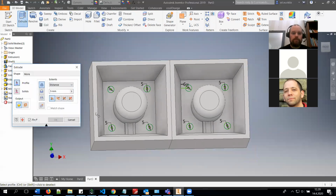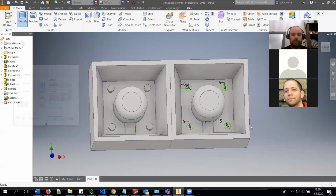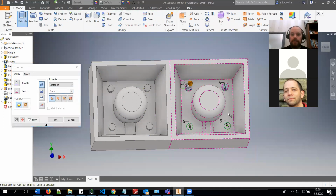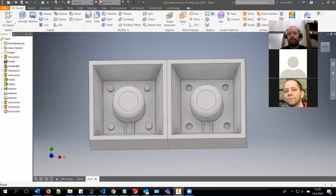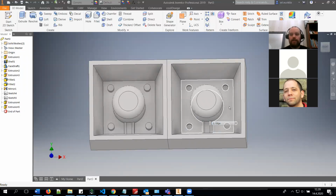And then you can create the extrusions. The other one has to be male and the other one has to be female. So they will fit together and create a single part. And now when you cast your silicone in this one, these parts will fit together and they will be almost like snapping together, and you can position them more easily. This is not the most stable way.